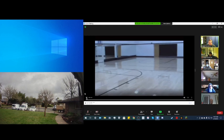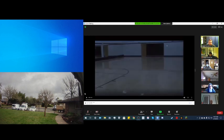Now that you've been introduced to Certex Comprehensive, let me walk through a little bit of the steps of this. The first step in the process itself was abrading the floor, so actually cleaning it first. Obviously removing the dry soils, just like anything else, cleaning the floor with an auto scrubber. Then they would abrade the floor with a surface preparation pad, that SPP, which is a maroon color pad.